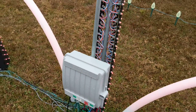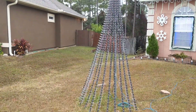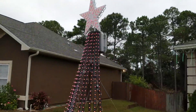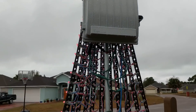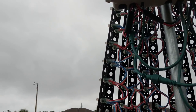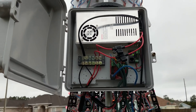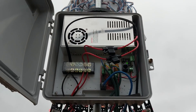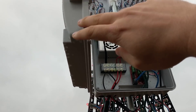There's the F4 in the yard running everything out there. I have a modest-sized pixel tree — it's only 12x50, plus a 60-node star. All that is wired in one box up here. It's pretty simple: just a single 5-volt power supply for the tree, a 4-port receiver for the Falcon, and a backup old single-port receiver from my E1.31 bridge days — which I can probably remove at this point.